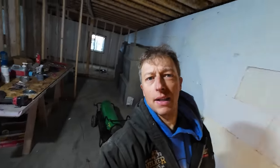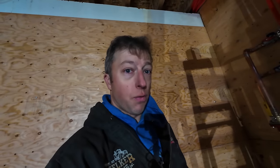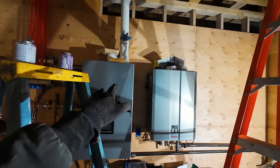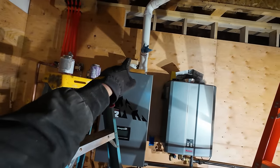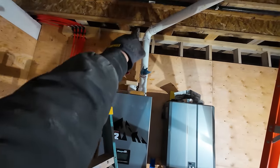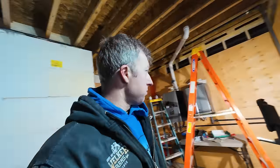Back down to the mechanical room — forgot my hat so you'll have to deal with the shiny head. It's about seven to nine degrees Fahrenheit outside, but I've got that green heater running so it's nice in here. The pressure test was set at 20 PSI, went all night, and it's still at 20 PSI. Now I need to get the venting done for the boiler — running the intake up and over. I'm waiting on CPVC pipe since it needs higher-temp PVC for the first 30 inches, then I can run schedule 40 up and out. Still waiting on a sensor for that unit too.